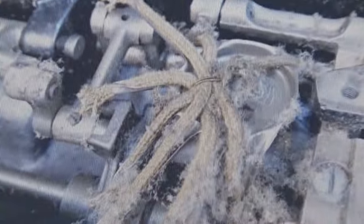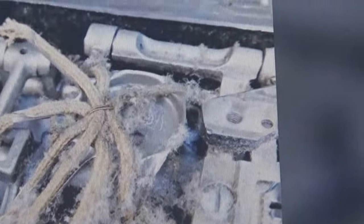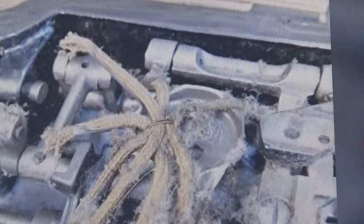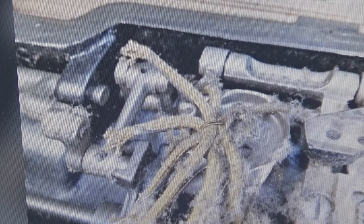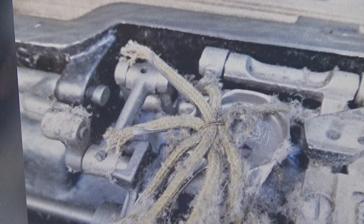So that little cup right there is where that oil, when you drop it through that cover, is going to go into that cup, and then it's going to wick out through all of those little arms. And it's going to lubricate, supposedly, all of those critical pivot points. But what about a pivot point right there, where that's going to be agitating back and forth? What about that pivot point? It just wasn't a perfect science. It missed a lot of the critical spots that, when I got this cover off, I right away went to town lubricating, to make sure that there was no resistance on that motor once I was able to start to bring the machine back to life.